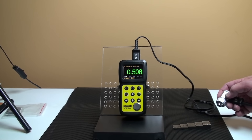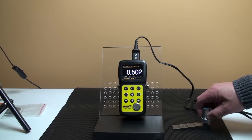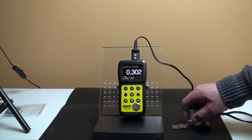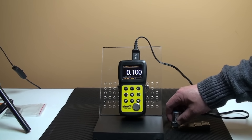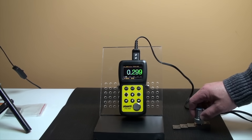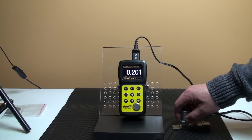Taking tests is very easy. After making sure your measuring parameters are set correctly — inch and metric and velocity of the material — place a small amount of gel on your workpiece, and then follow with the probe on the workpiece. Readings will show on the screen. Be certain not to use too much gel; use just enough to remove air from between the probe and the test material.